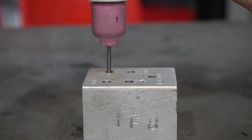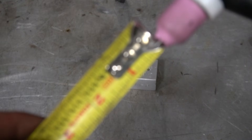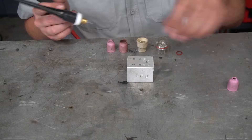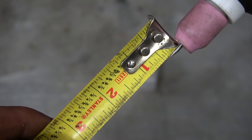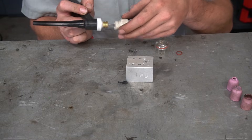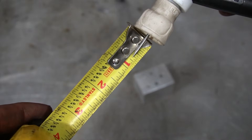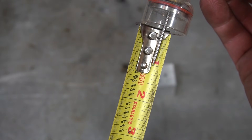As far as operation is concerned, just pull your tungsten out way past the maximum allowable amount, have it loose, stick it down inside the hole, lock it down, and you can verify that you have the correct amount of stick-out. The tape measure isn't the most accurate, but every one of these comes up pretty much right where they need to be. Check our number six — there's three-eighths of an inch. Number 12: stick that down, lock it down, pull the tape measure — right there, three-quarters of an inch. Same thing with the number 16 — lock it down, pull it out — one inch of stick-out. Perfect.